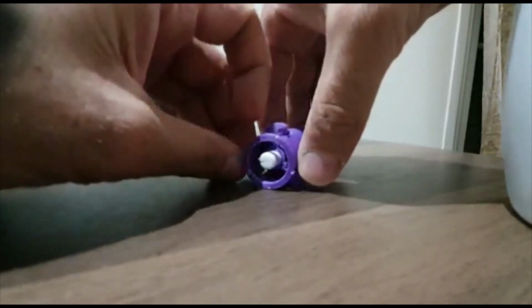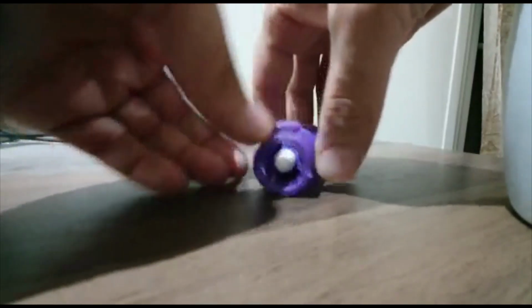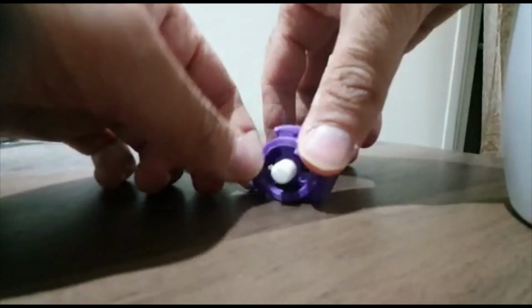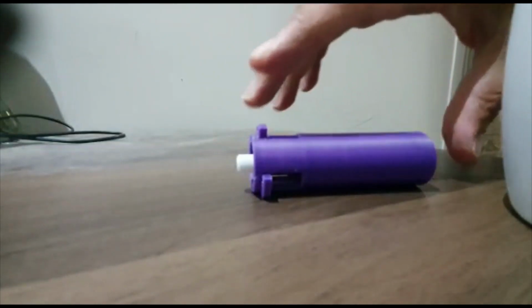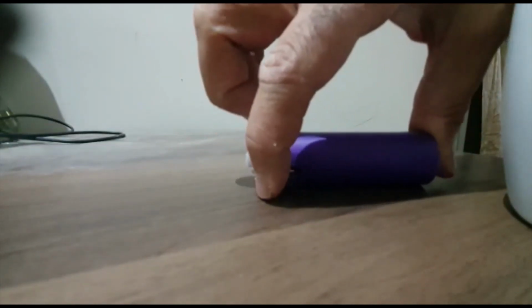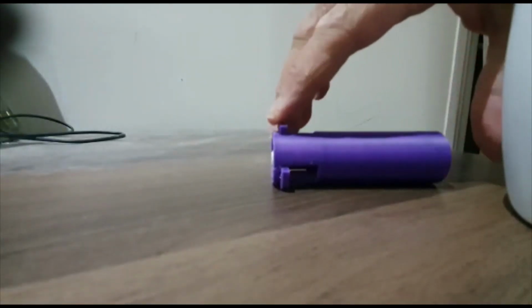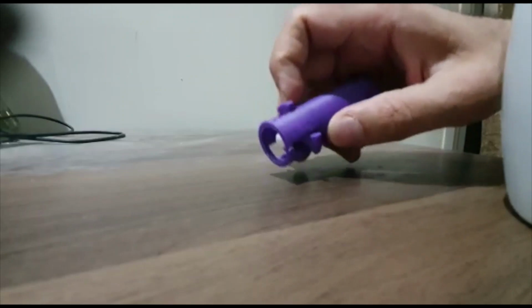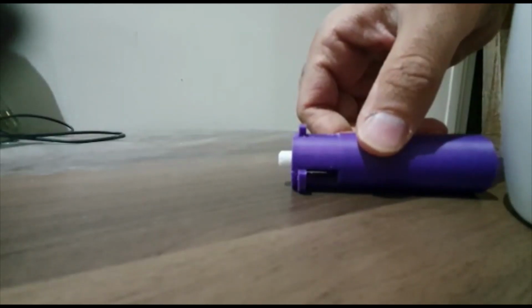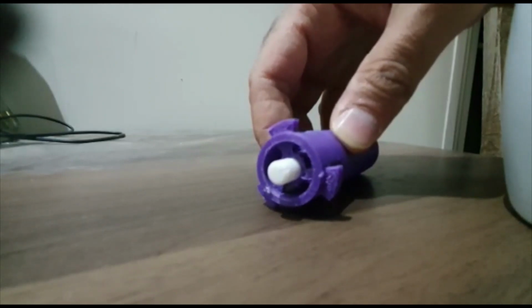So I put a little slit in the end of the cam to watch it rotate. So it comes out there. This is a side view, maybe that's clearer. So it's got a stroke of about 6 millimeters. So that's in. And then that's out. And you can notice that that cam is rotating.